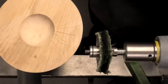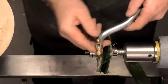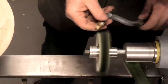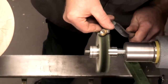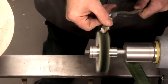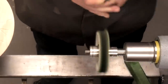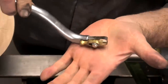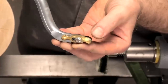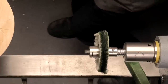I don't know if you've got, it's not on here, is it? I can move it, actually. I've got enough, that's right. I've just moved the woodcut cutters. On these, I've got a top which I can move over. I can just swing it a little bit. It's a little bit loose on that. Now, on here, we could, actually, if I can get in. So I'm polishing up towards the cutting edge. So this is running in reverse, so I can use that stitch wheel. All right, so the joy with this, by running the lathe forward and reverse, I'm running away from what I'm sharpening now. That looks nice and shiny now. Right, so we polish that outside face coming up to this cutting edge right at the top. So that will be good there. So something like the stitch wheel would be fantastic for that. Let's just put that one back in place and make sure them pull up.